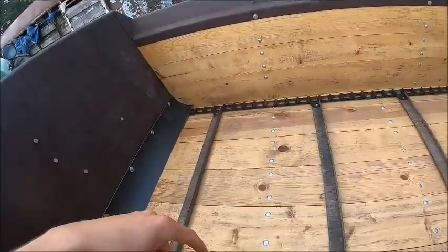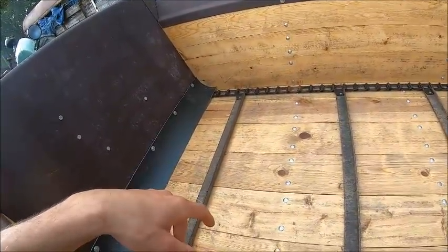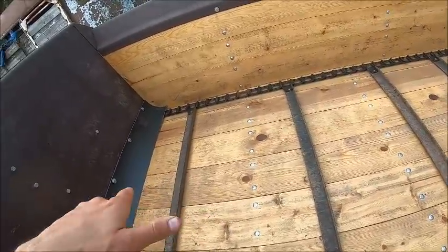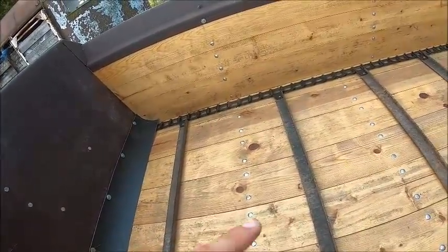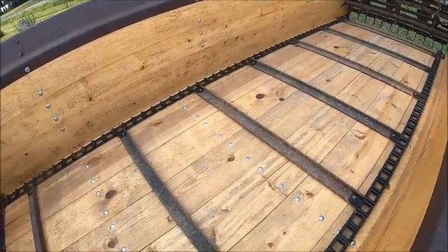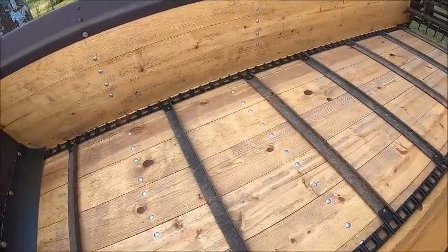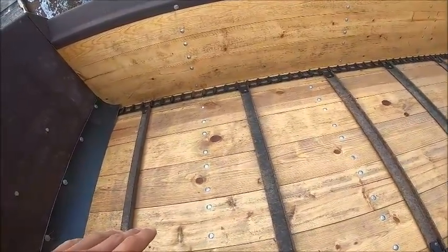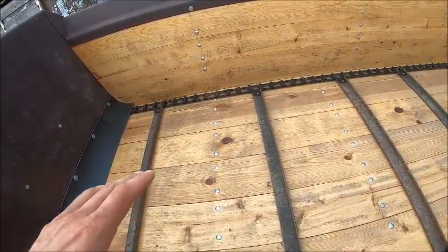But when I put this one in, I made it the way the book said, you have 15 bars in it. You make 10 bars with 7 links trailing and 5 bars with 6 links trailing. And that's supposed to give you the right length of chain. Well, I made it the way the book said, and it was still too tight, so I had to add a link, which tells you how far the original chain was stretched.